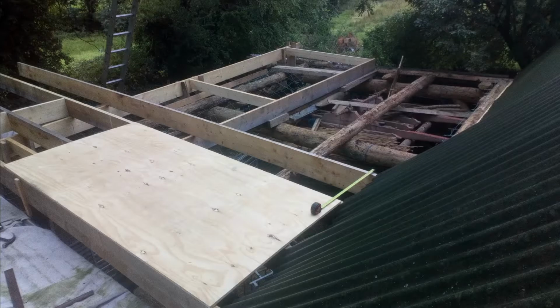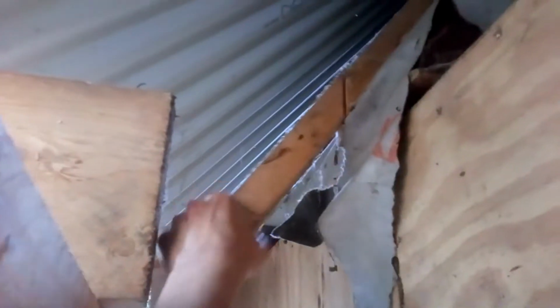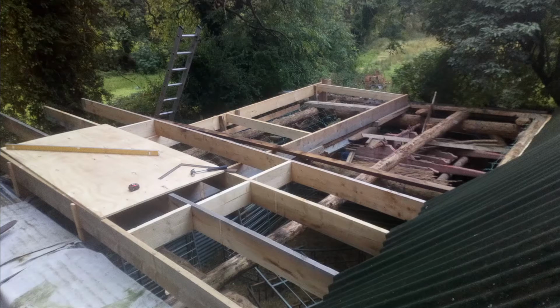We got to measure our distance, make sure the 4th joist is far enough apart, and bloody hell, this joist is stuck, and we're gonna have to get rid of this extra support for the old roof tab. So we get our saw, and well, we just gotta awkwardly cut this thing off. So we do that to pull it off there, and that will free the joist to be able to slide all the way into there. Just bad luck, but we get the 4th joist in there with its supporting noggins.